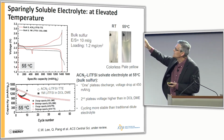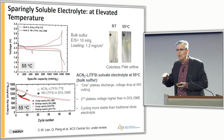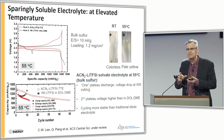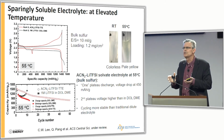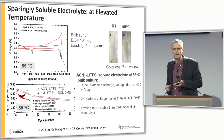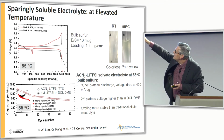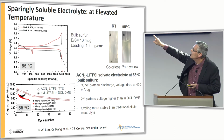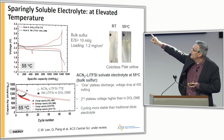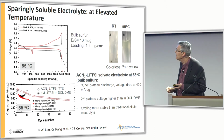And there's some details about this, 3 critical details. The initial potential is about 2.2 volt. This is lower than the 2.3 volt that signifies the conversion of sulfur to long-chain polysulfides. So we already know that we're not producing long-chain polysulfides in this system. Then we get this potential excursion, and I'm going to show you that that's an overpotential. And then we come back up in potential, and actually the mid-range of that curve has a potential that's several tens of millivolts higher than the 2.2 value.